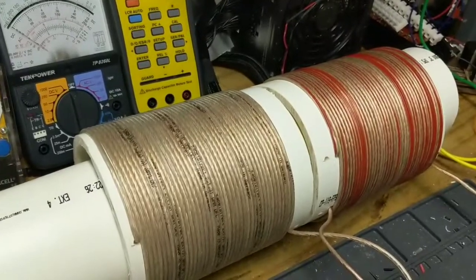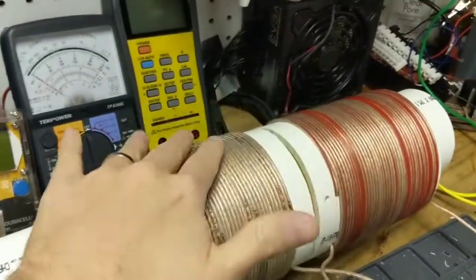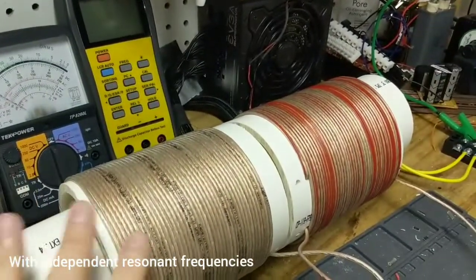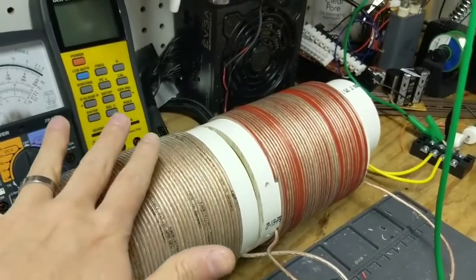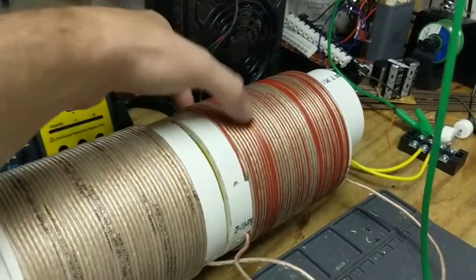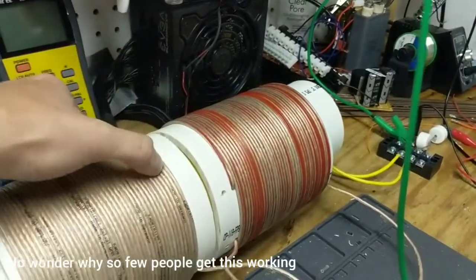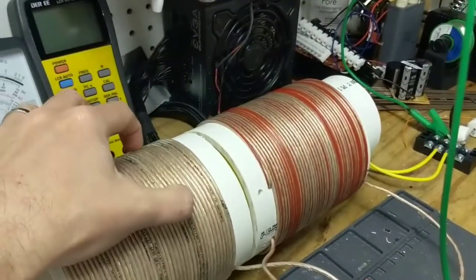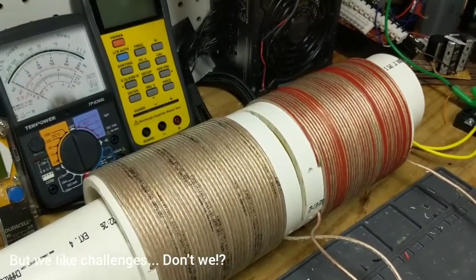So now we have to think about this because it poses an interesting problem. If we think of these as two independent coils, we have a couple of things going on that will make tuning very complex. I can definitely tune individually with some additional capacitance — variable capacitors would probably be easiest. But then we also have the coupling to deal with of L1 inside the different L2s. When one is more coupled than another, you might still get a stronger output from one than the other. How to deal with that, as well as tuning the capacitance at the same time, may pose a challenge. But it's something I think we'll love to consider as we develop the system further. Thanks for watching.